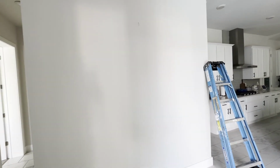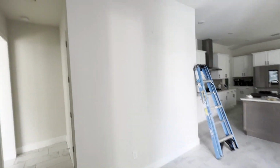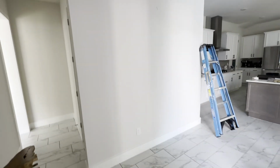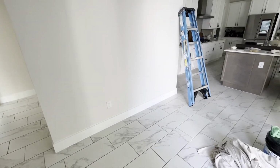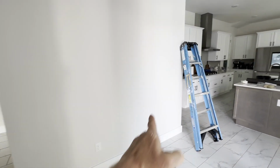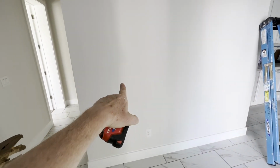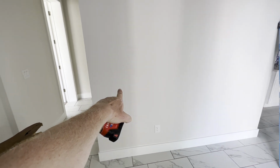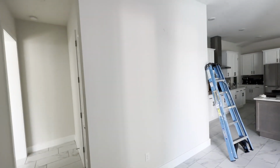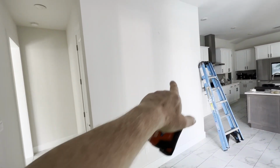How do you do that? It's a little calculation. Do you understand why? Your grasscloth seams are visible, which means each panel has its own character. If my first panel ends here, and my second panel ends here, and my third panel goes over to here, that's a major mistake. Because if I can see my panels, just right now, look at the light coming in.